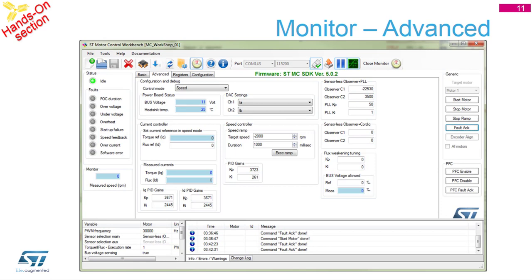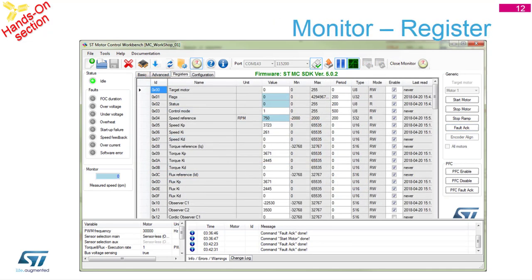Going back to the monitor view, in the Advanced section - as previously explained - there is an option to set the control mode as speed or torque. In the drop-down you can choose either fixed speed or fixed torque. In both cases torque regulation is always active, but on top of that you can also have a speed loop. In the middle red rectangle, you can configure the speed ramp - you set the target speed and how fast the change from the current speed should happen. For example, it is set to 1000 milliseconds to go to minus 2000 RPM from the current speed.